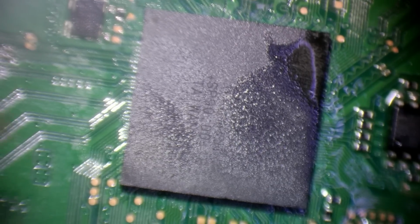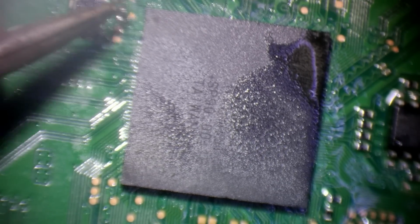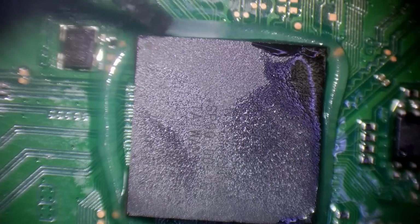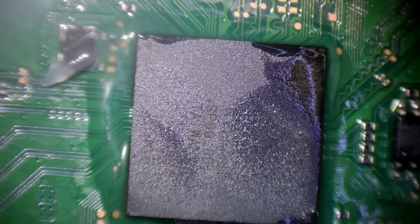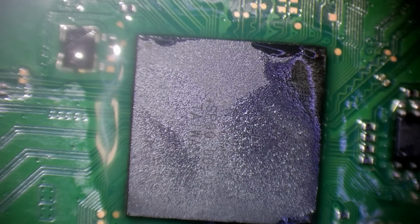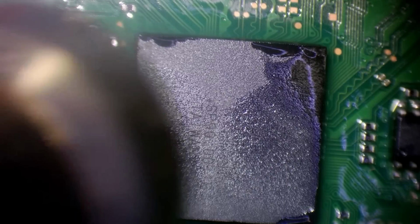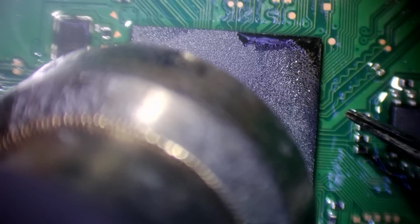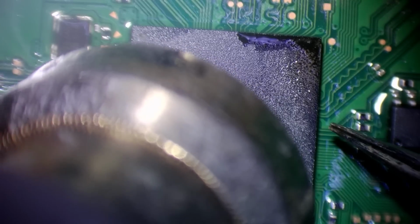I did compare pin number one, by the way, so we've got a dot there and an arrow there. Tells me where it's going to go. Add some more flux. Go to 40% airflow. And then I can flow this down fully. Okay, it's pushing itself back out. There we go. That's just dropped. There we go.